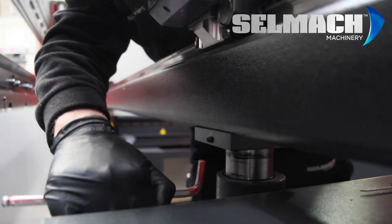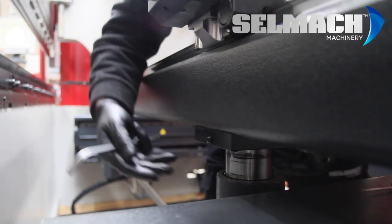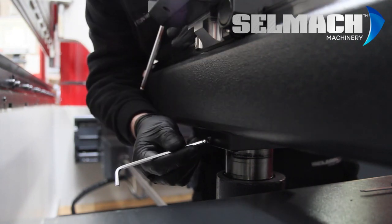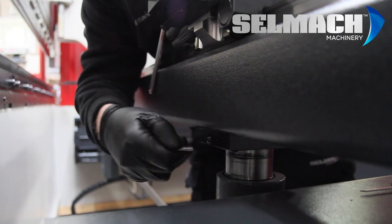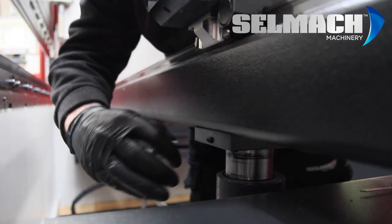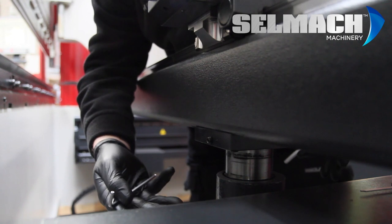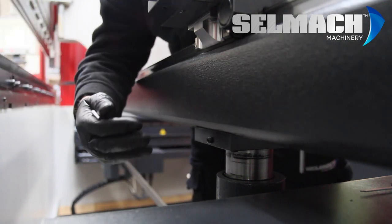Basically, we undo here and at the back, which bolts this bar to this plate. We have a grub screw here and the same at the rear. You slacken one off and tighten the other, it'll go in one direction. You slacken the other off and tighten this one, it'll go in the other direction. Once we've done that, we check the measurements once again and repeat until it is parallel.